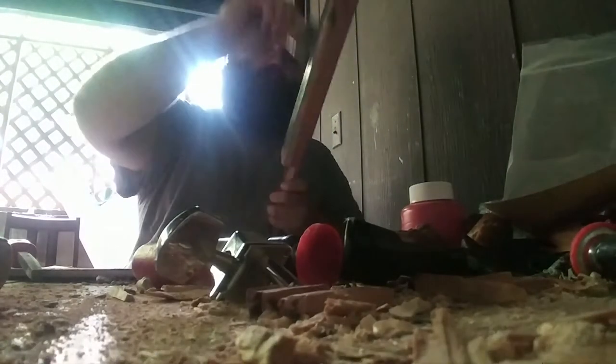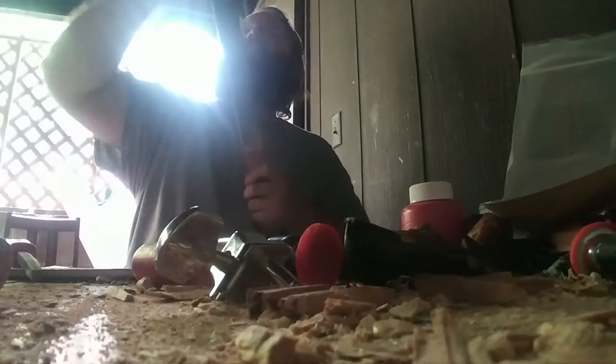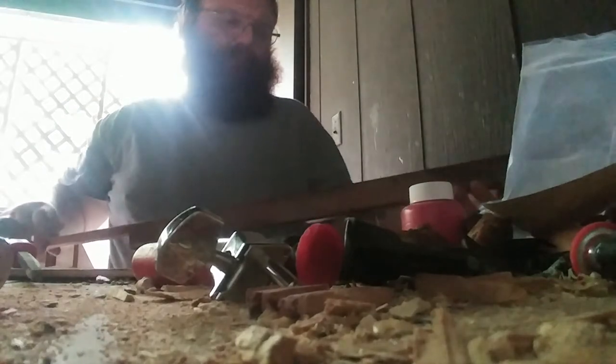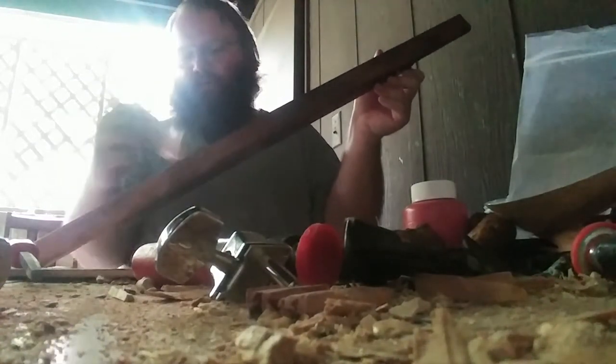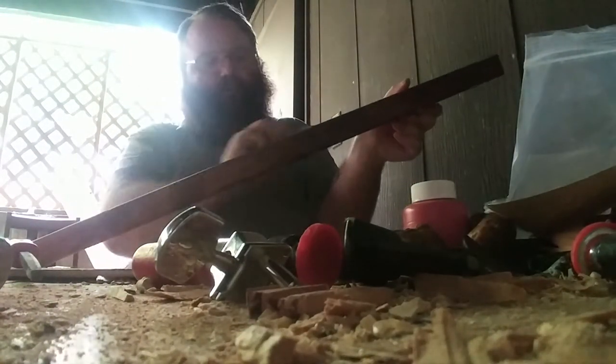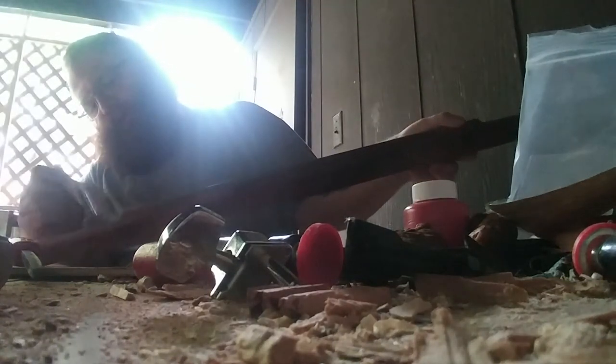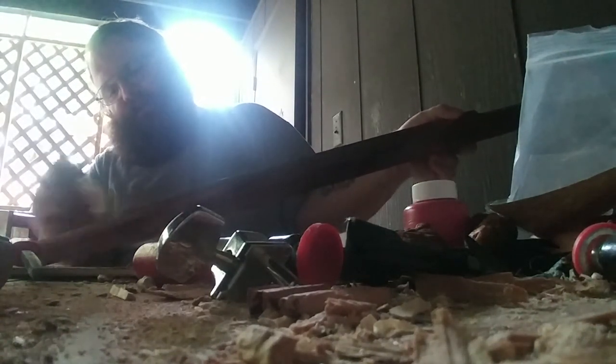All right, so. Just has to be a real quick brush. Now, obviously, green and blue are cool colors compared to the red. So the red goes on, it matches in with the wood, it does all kinds of crazy things. A brown would do something similar. It would just kind of accentuate in with the wood. It can almost look like it's painted or just very bright and brilliant. Whereas the blues, the cooler colors, the blues, the greens, are going to catch into certain parts of the grain and highlight those. And then especially after the teak oil will recede and almost beyond non-existent, so you get this multi-toned look.